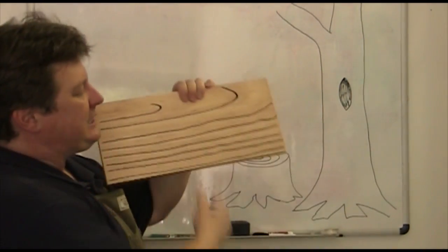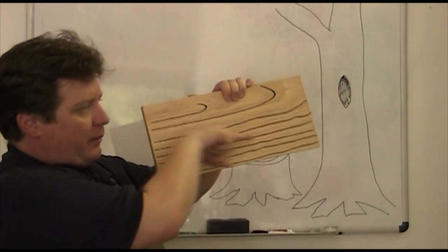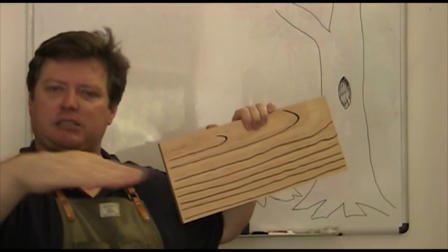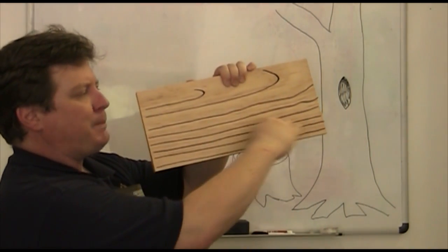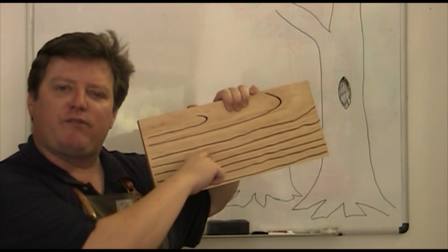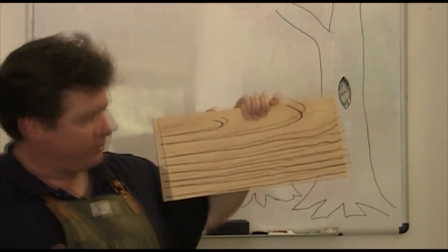What we talk about when we're saying going with the grain is basically we want to push the grain down as we go across it. So I would go this way and it would be laying those fibers down so that they compress and we slice them off. If we were to come back the opposite way, basically I would hit that point and the crack would develop going down. That's kind of what we call tear out or split.